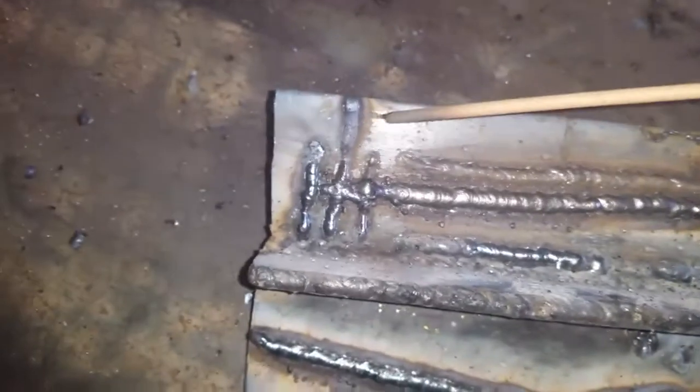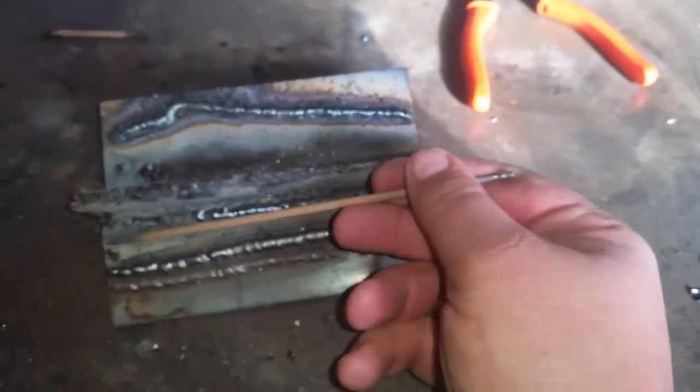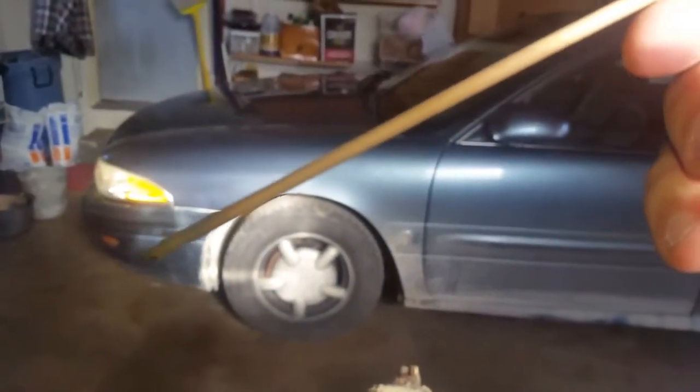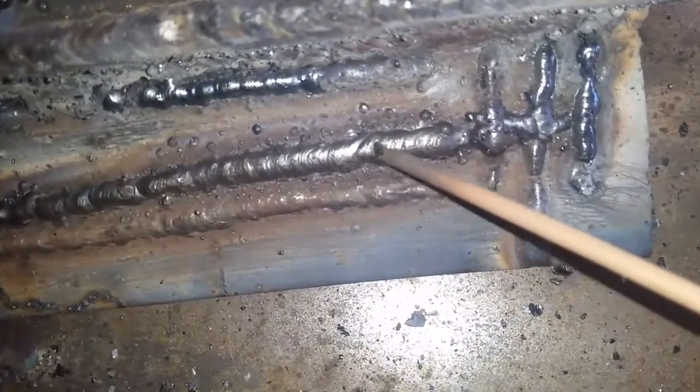If I only got going — I had to find out how to use it while I was actually welding. I found out that until I got some heat going in it, I had to start out with a really steep angle, or shallow depending on how you look at it. Horizontally it looked like this; once I got the arc going, I turned like that. This was my first weld, this is the second. You can see there's stop-starts here, but it looks like it smoothed out — I started getting the hang of it.